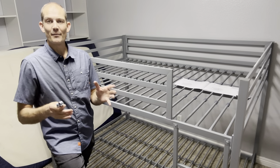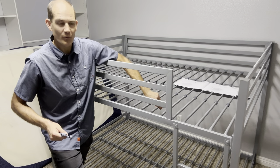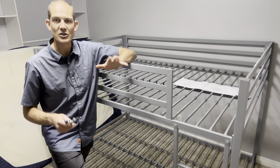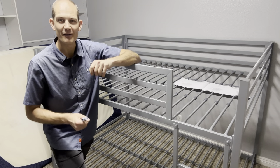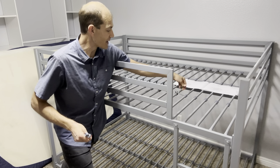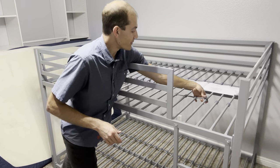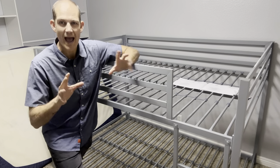The bed is really coming together — I feel like I'm 99% done. The last bit is putting on these connectors, which help keep the bed from shaking back and forth and creating noise. I measured based on the instructions for placing these connecting inserts. One thing I found: it might be nice to wear gloves — there's a lot of pushing and some vibration, and gloves will really help keep your thumbs and fingers less fatigued. They push down, snap, and you alternate where they go to snap in place. Being that they're plastic they have some give, but they really do add rigidity to the bed to reduce rattling when somebody's sleeping in it.